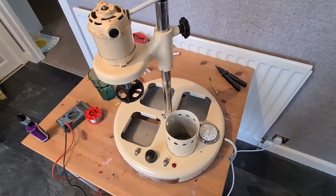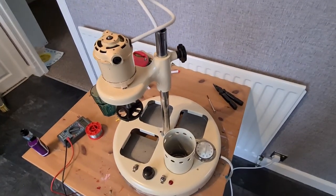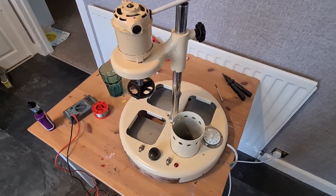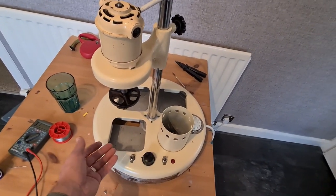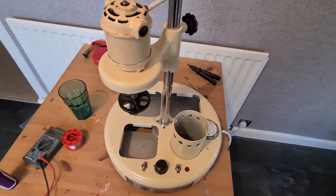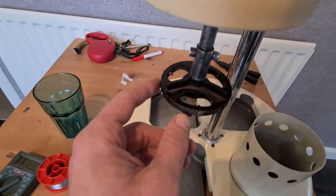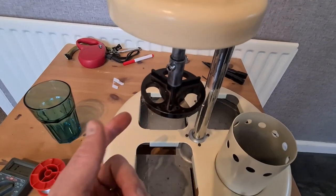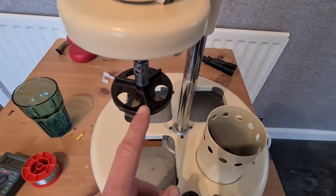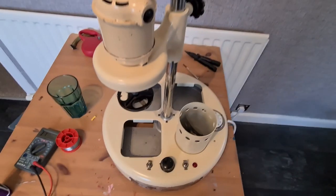We're plugged in now. With the pot turned all the way down you get a tiny bit of voltage — enough to turn it a tiny little bit, which is a bit annoying but fine; you just have to turn it off before you put a cage on. As the pot goes up it kicks into action — you can fine-tune the speed quite well, from slow all the way up to lightning speed. No sparks in the motor or anything, which I'm happy with. Motor sounds nice, bearings sound nice, all the way off and then the heater works as well.